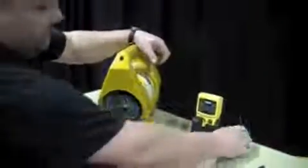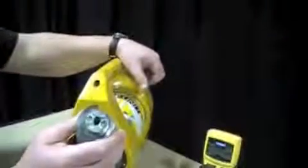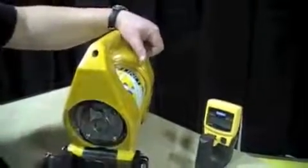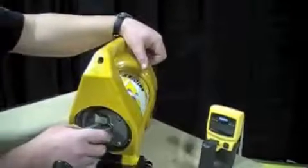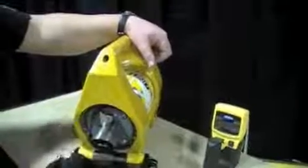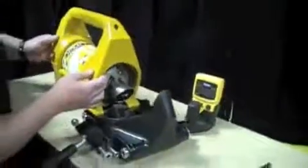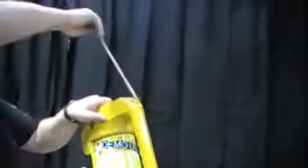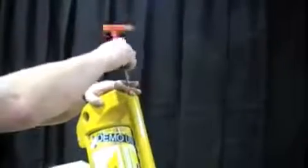You want to install the collimator. The collimating guide tube has the bayonet fitting attached or built right into the collimator. Take the outlet port cover and put it to the yellow position. Line up our bayonet fitting, insert and turn down. Open up the outlet port cover, then flip up the exposure device. We'll insert the shoe bolt through the handle, hand tight — that's good enough.